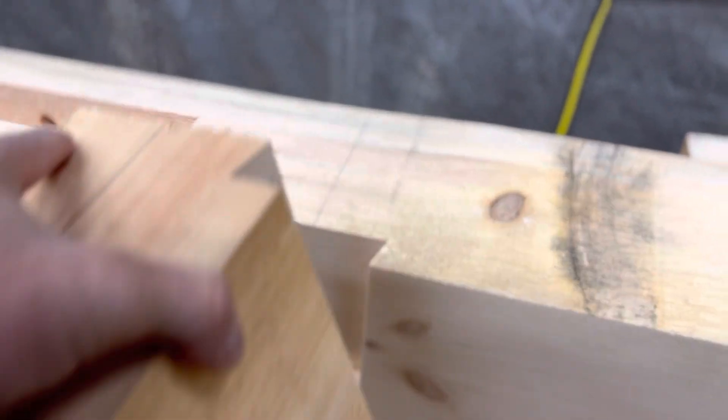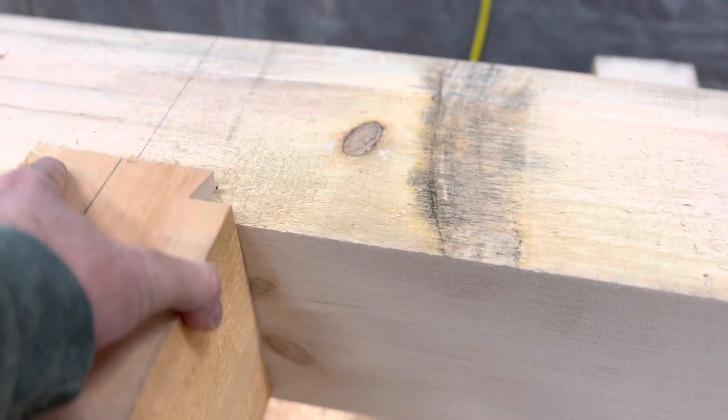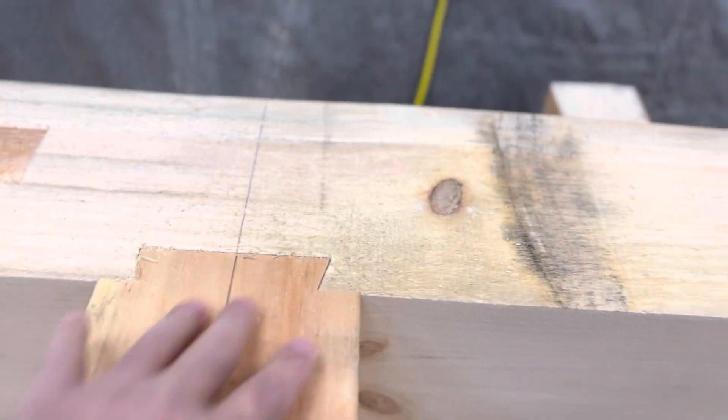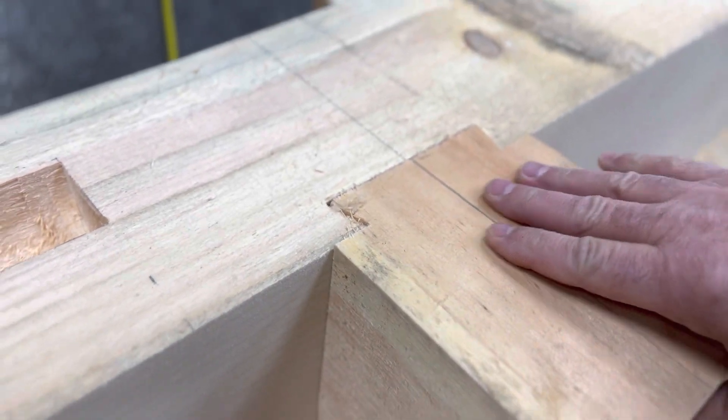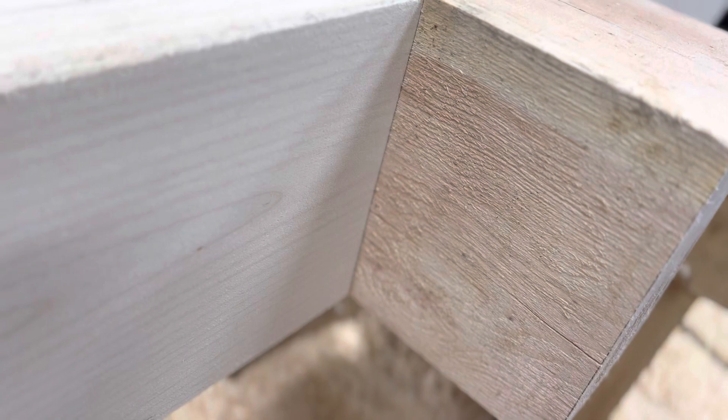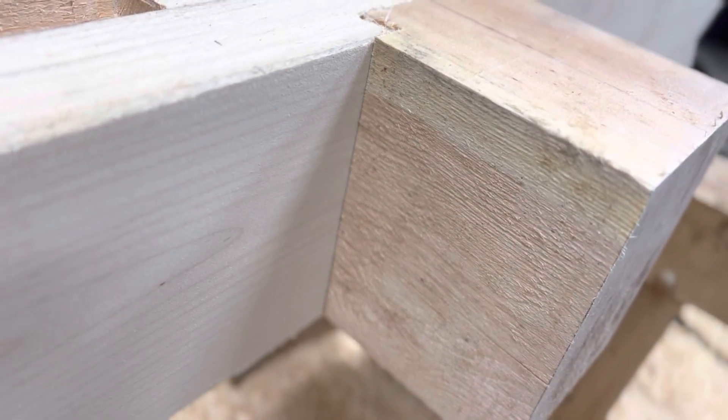You see my registration mark is still on the top of the rafter. I'm going to put this in. Presto Mundo. You'll see it's standing a little bit proud here. We're going to have to tap that in, but because it's a test piece, I'm not going to tap it in. But what I want to show you is — look how that fits up on the side as far as squareness goes.